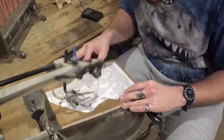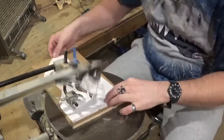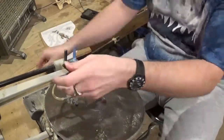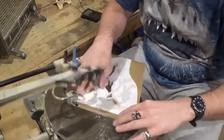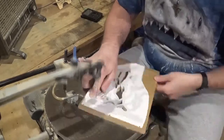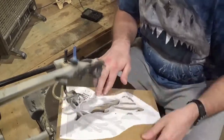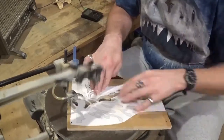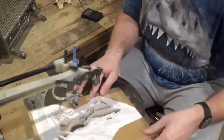Just going through here getting all the internal cuts done. When I get done with this one, we'll begin the final outside cut. You will see me lubricating the blade with a bar of soap to help keep the blade cool and reduce burn marks. We're going to begin with the final long outside cut — just take your time and let the blade do the work. With this being quarter inch material, it will be very fragile once it's released from the wood, so just be very careful with it. Just one long continuous cut.